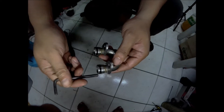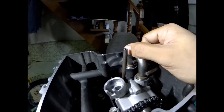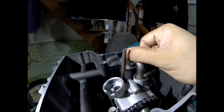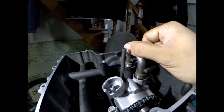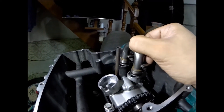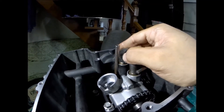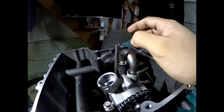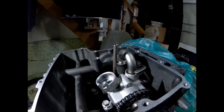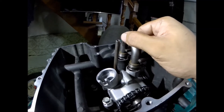So it's important to replace these O-rings. As you can see, I can just slide this part in and out with very small resistance. I suspect this engine failed due to an O-ring failure. A very small amount of leakage will drop your oil pressure, and the bearings of the crankshaft and the connecting rod will suffer from the dropped oil pressure.